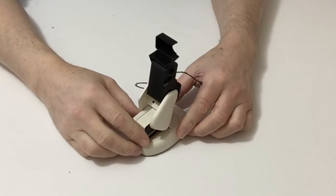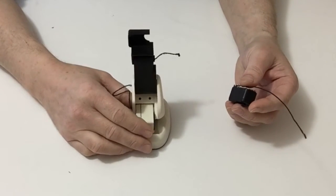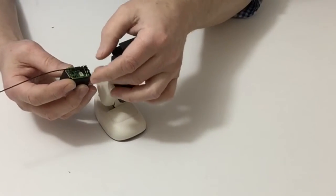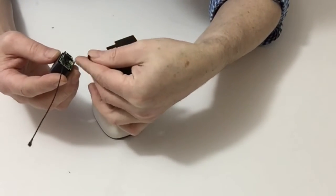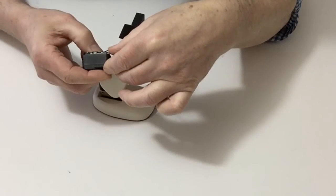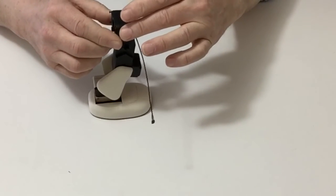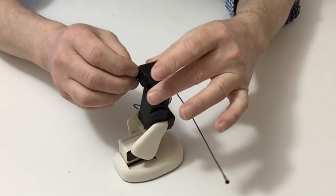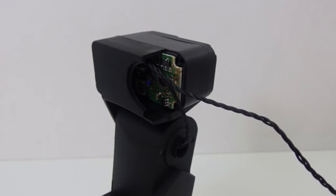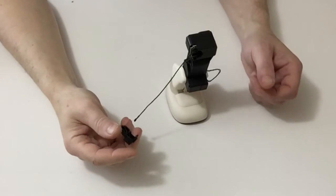In this part of the stage we're going to be working on Robby's right leg. Take the servo from stage 33 with an ID of 2, and note the orientation of how it's going to be fitting. Connect up the servo as we've done before, carefully placing it into position, then place the servo into its housing and secure it using two of the long screws.